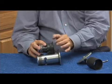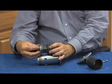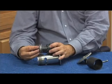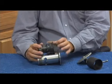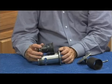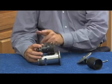High pressure sits on this side of the elastic element. My low pressure coming past the first check now butts up against my relief valve disc. So it's a non-hydraulically balanced relief valve. There is no water to assist the low pressure side of my elastic element. As we said earlier, the only thing I get my additional load from is the heavier load on the spring.